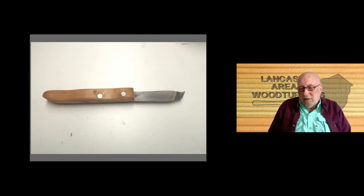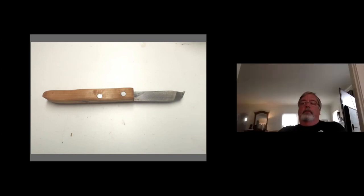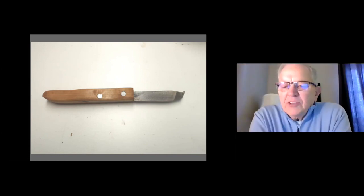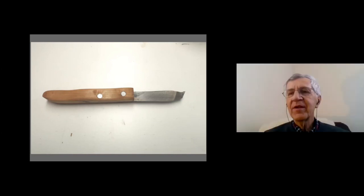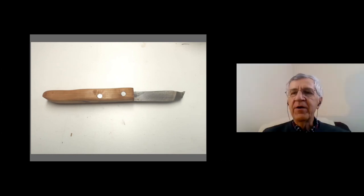Just cut the tooth out of the saw blade at a different angle. And I can try that too. I made a tool just like that. I have a diamond grinder and I ground the top part of that tooth down so it's more flat. Looks great. Okay, that's helpful.